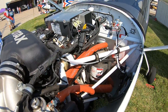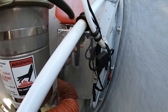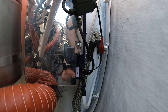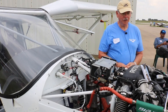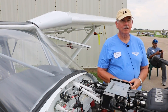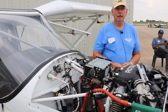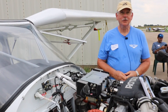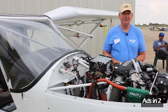Are you finding that you use more MoGas or avgas? Up until this trip it was MoGas — last year I hauled MoGas out to the airplane at every stop. But this time I actually had to use 100 low lead. The engine prefers automobile fuel or at least 91 octane. Here at Mexico, Missouri, they have MoGas 91 on the airport. Did you notice any performance difference going from 91 to 100 on your cross country? Yes — oddly enough on takeoff I was getting about another 50 RPM out of the engine, which surprised me. I guess it likes that little extra octane.